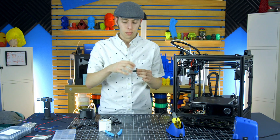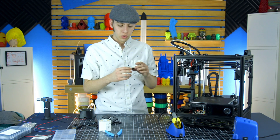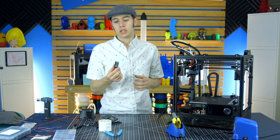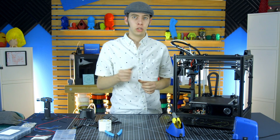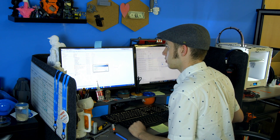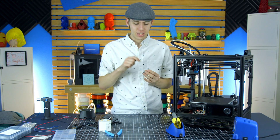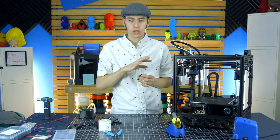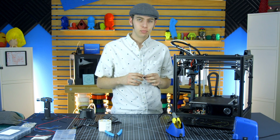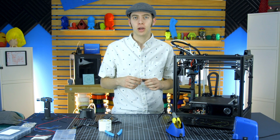There you go — here's the board, got all the pins in there, got the connectors for the amplifiers which we'll connect to the speaker. So this is for the most part wired up. Now I just need to put the audio files on here, which is really simple — I just plug this into a computer, it treats it like a flash drive, and I drag and drop audio files, either WAV or OGG. You want them as small as possible because this only holds two megabytes, and one file takes up a quarter of that, so play with compression rates.